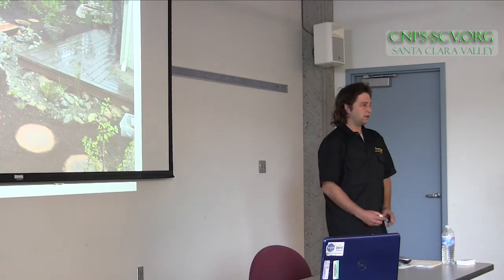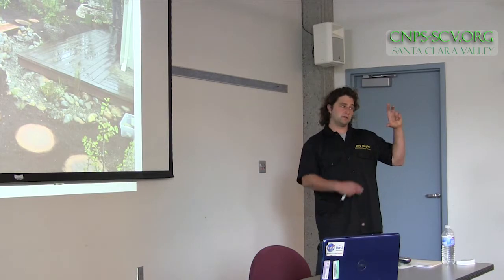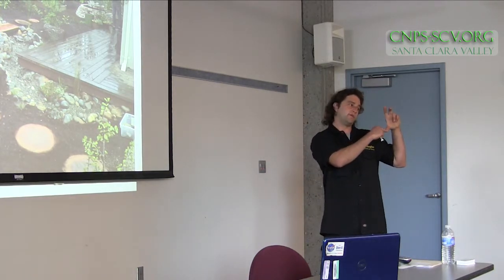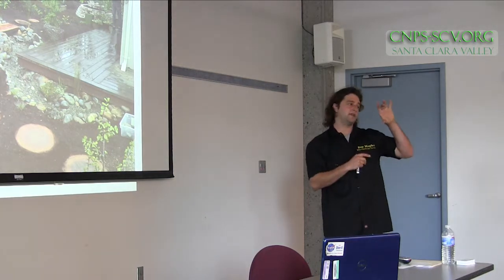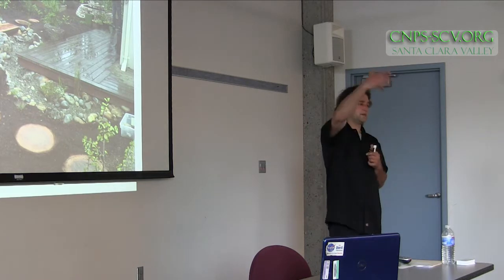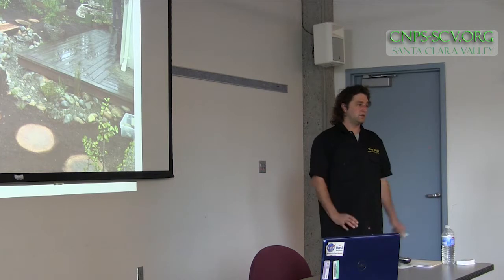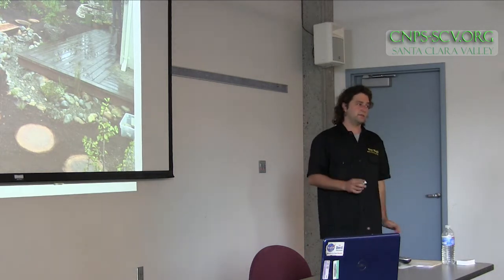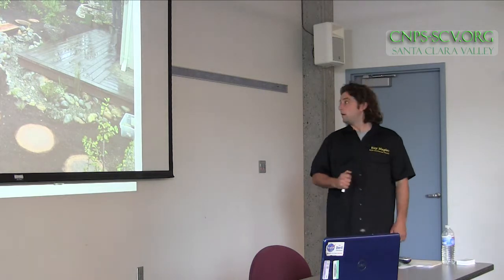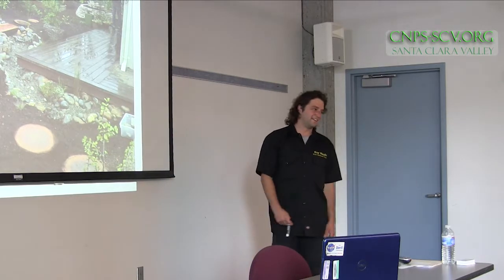And if you notice, on the foundation of your house, where the bottom of your stucco starts, you don't want to pile up your mulch or compost right below the stucco. You want to maintain that gap at the foundation so there's less of a transition for the termites to come around your house. And just don't water by your foundation. Don't have irrigation around your foundation. Those are all tips to keep it more termite safe. Don't have your rain spouts right by your foundation. Don't have your rain spout go to nothing and just sit on your deck.